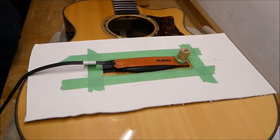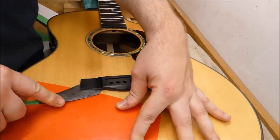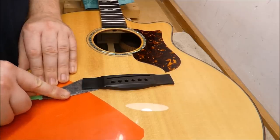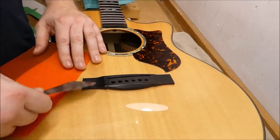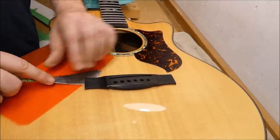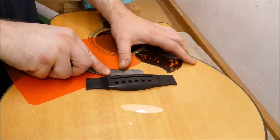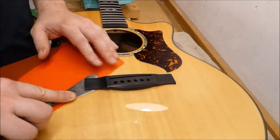I've got my little heat blanket working on it there — this will take ten minutes or so to heat up. I'll start working on one side and then the other and take my time. After getting things good and hot, the palette knife slips in there pretty easily. You can see I'm protecting the top with a thin piece of mylar here. Some people like a wider blade — main thing is it should be pretty thin, not razor sharp but with a really thin edge. And you should really pay attention to grain direction — you don't want to be forcing it in sideways to the grain. You also want to cut from both sides just to make sure there's no tendency for the knife to go shooting through if it suddenly gives way.